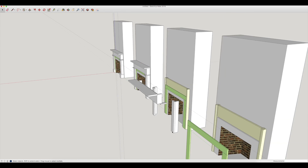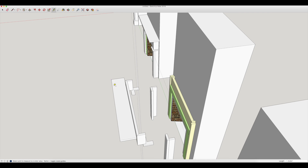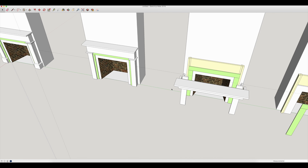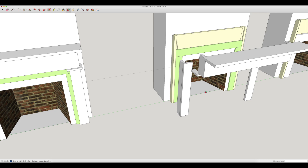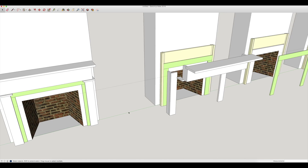Now that I've done all of this, I can come through all my boards and hit T for tape measure. I can go through and say, okay, I need a board 71.5 by 12 by 1.5, and I can go through each board and measure it out. Right here I've got 4.75 by 1.75, and this one's also 1.75 by 6.5, and both of those are 45 inches long. And I can draw up a cut list.